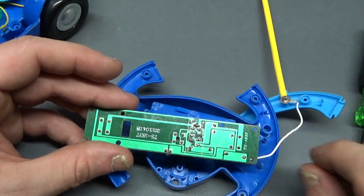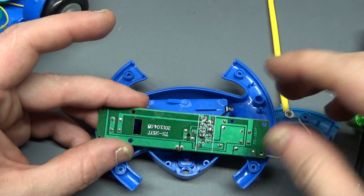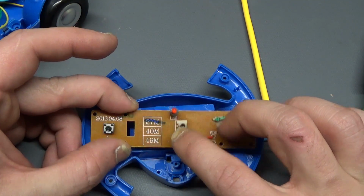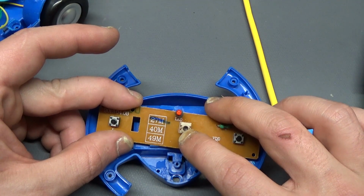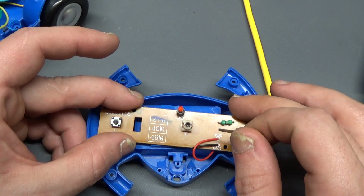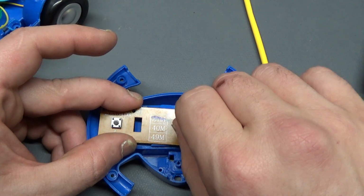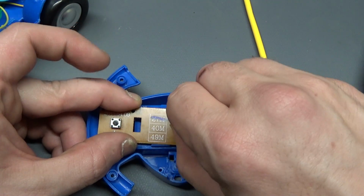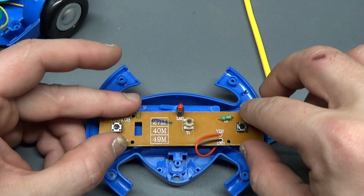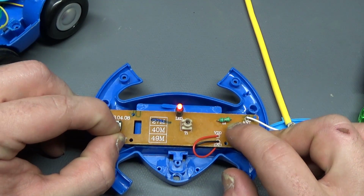Now I looked at the back side thinking maybe there were some parts that I could repopulate, or some parts that are unpopulated so I could just move a component over. So it looks like, since there are no replaceable components on the back here, that the frequency is determined by this transformer here, and it is a variable transformer. You can see there's a little Phillips head there, which can be adjusted. So you'll need a narrow-headed, flat-headed screwdriver. I don't have one to the right dimension, so I'm just going to use this old nail to adjust the transformer's ratio here. It's just an iron core with a screw on it so it can move up and down to adjust the frequency here. So I've turned that nearly an entire rotation, and now it's not controlling either vehicle.